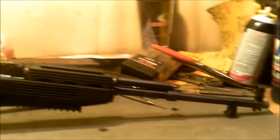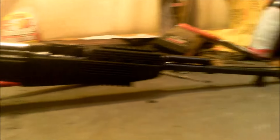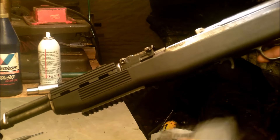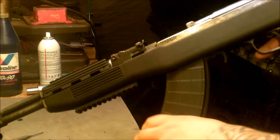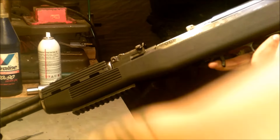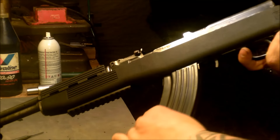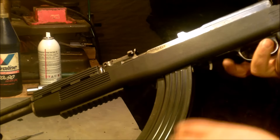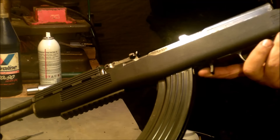Overall I'd say the installation was pretty simple — very little fitting, very little material needing to be removed. Now we're going to test fit some mags. This is a 30-round polymer magazine from Pro Mag — fits in really nice and smooth, rocks a little bit forward and back but none side to side. This is a 30-round blue steel mag from Pro Mag — that locks in as well, but that one wobbles side to side and front to back quite a bit. I will do a video testing these two 30-round mags head to head, so look forward to that coming on the channel soon.